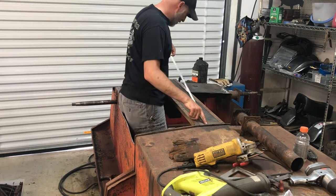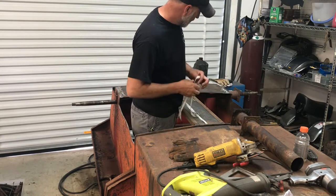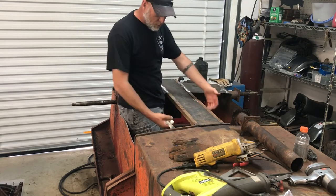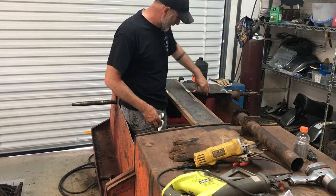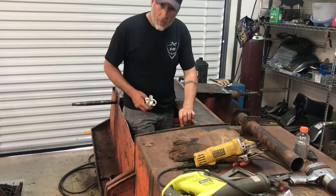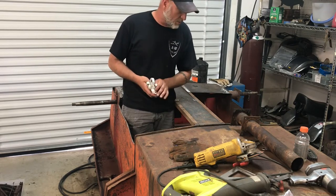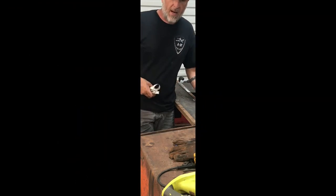Lengthwise we're at 41 inches, so basically a big square is what you're looking at on the bottom of a coot. I've already added this piece in here — it's going to be welded fully on the other side; I just tacked it in. This is the piece that gives it its rigidity right over the axles. I'm going to go a little bit thicker on the material than what the coot actually came with — the difference is about 20 thousandths, so pretty small. Let's get set up on the plasma table and get that cut out.